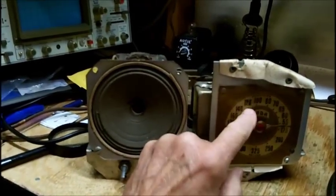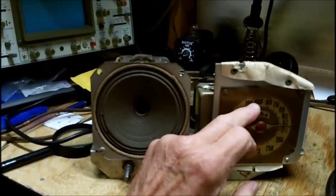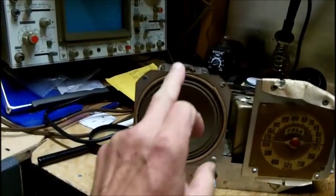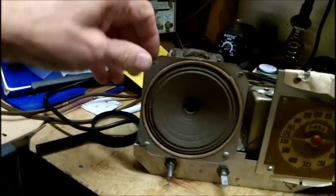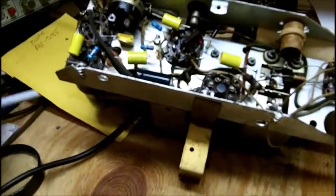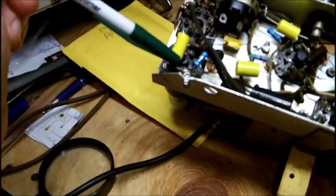So that is out. I'm not touching this dial. If I sell this and get a good price, they can recone it. I will not pull it out because it will no longer be original. As far as restoring the capacitors and resistors — every resistor but two in here are off value. Every single one except this one, which I think is 130 or 150 ohms, and this one — these are close enough and are cathode resistors.